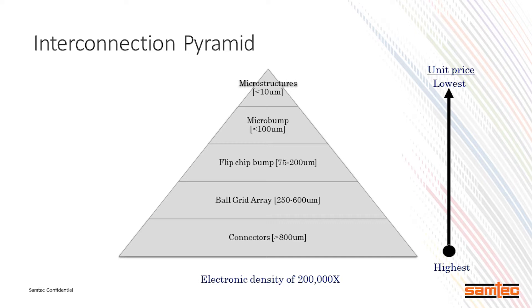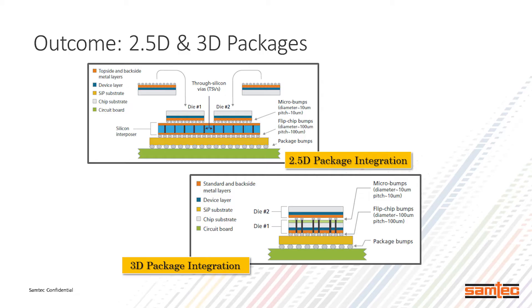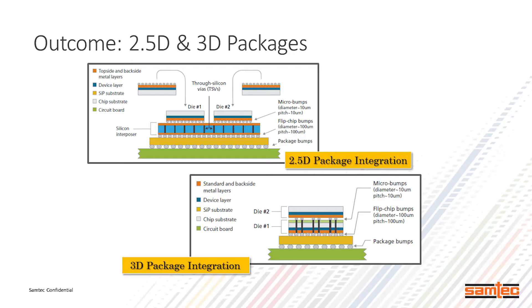Our scales are pretty tremendous. When we talk about integration, one aspect is packaging—we can start adding more and more chips to a single substrate, or what we now call an interposer. We've chosen to do both organic printed circuit board material and glass. There are several glass variants—silica, quartz, sapphire, zirconia—and depending on the application, particularly for biomedical, we also need biocompatible materials.